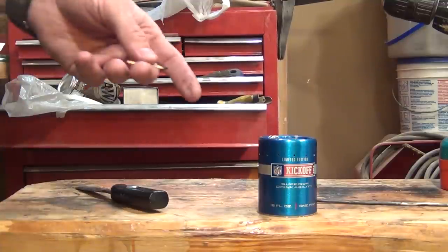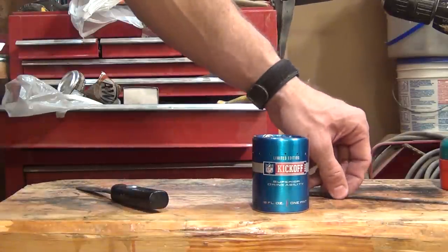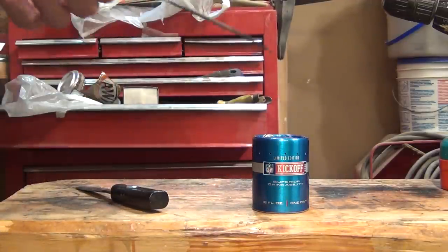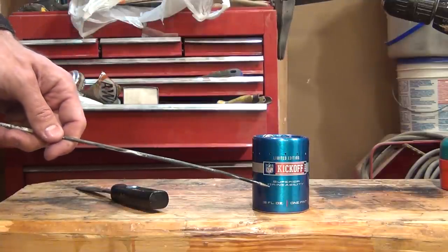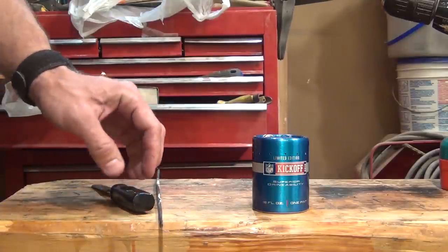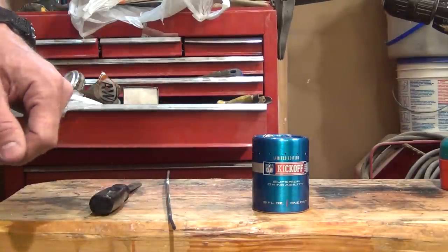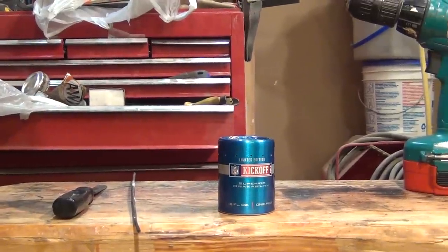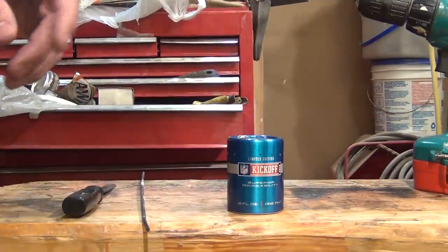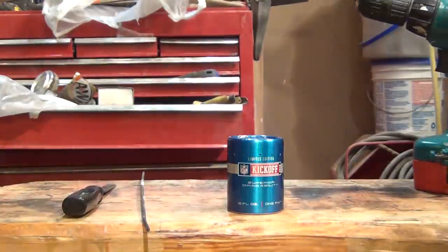And what we have to do now is we have to wait for this stove to prime. And what I mean by prime is the aluminum has to get hot, because between the outer walls of the can and the inner wall, it's going to get hot and that fuel is going to boil in between those layers of aluminum. And that boiling process turns that fuel into a gas, and that gas will come out these ports, and that's where our flames will be. Now, because the lights are on, you can't really see that it's lit, but it is. It's a very blue light, so I'm going to go ahead and kill some of these lights, and we'll take a look at this thing in the dark.